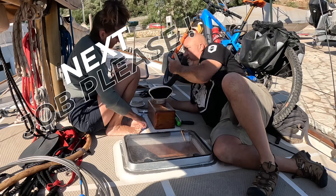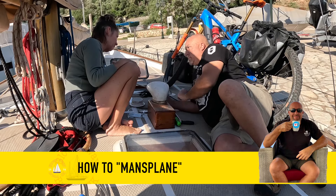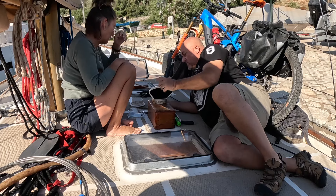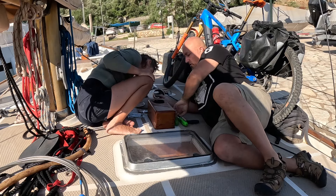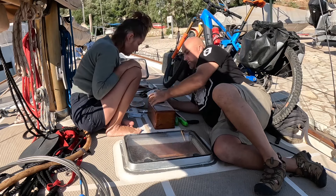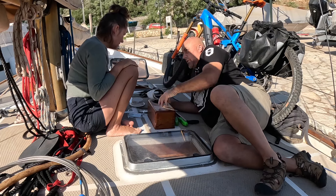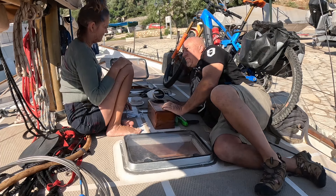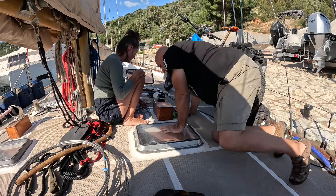You have your vent facing away from the ocean because as you hit the waves the spray goes up. If you have your vent facing toward the ocean, the water goes in. It's better for ventilation to face inward but water can get in, so it's supposed to face away. Inside there is a piece of wood that comes up vertically — water goes in and there are drain holes on both sides so it runs out. There's also a separate compartment with another piece that lifts up so if water goes past the baffle, it doesn't go down the hole into the vent. That's what the dorade boxes do. Mine was connected directly — that's a bad design. Smart design overall. I didn't design it, I just keep varnishing it.